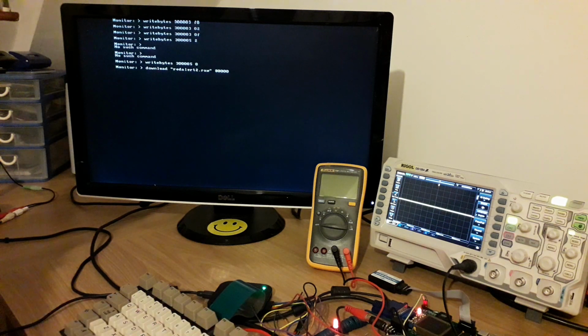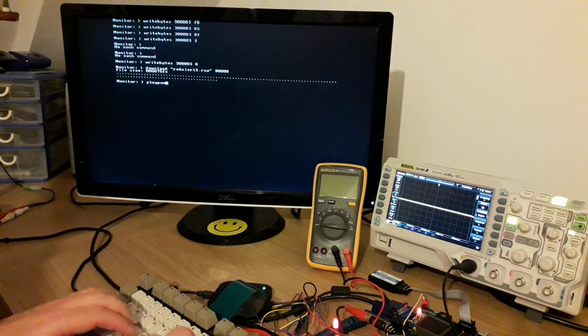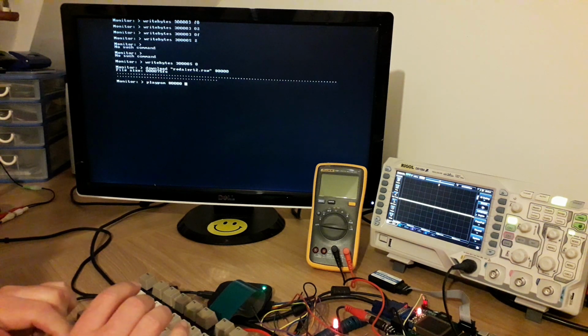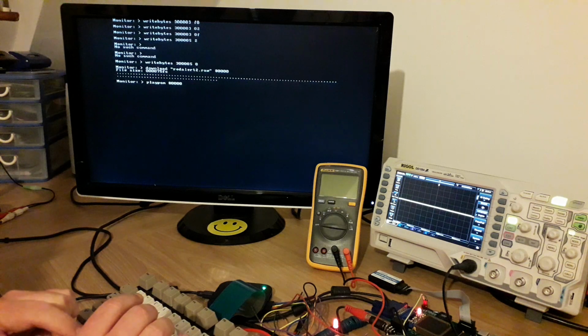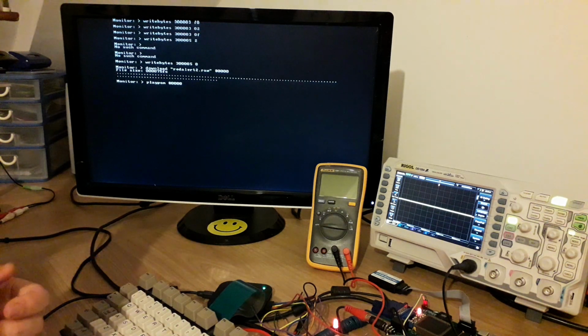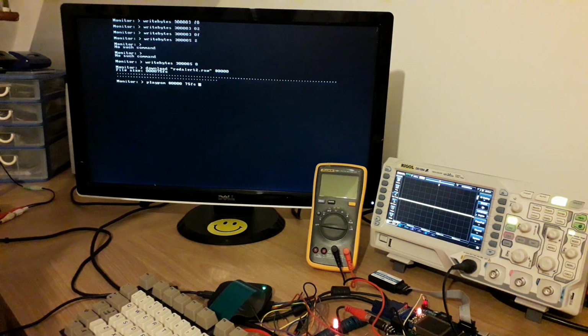The location. There we go. So what's that? That's just under 32 kilobytes. 75FC. What other command to bring that back? So this command essentially loops through that memory array and writes each byte to the CPLD SPI master.